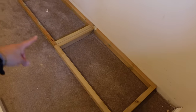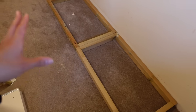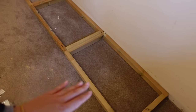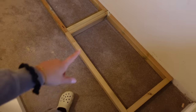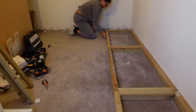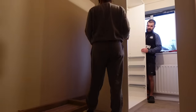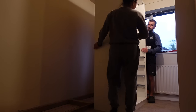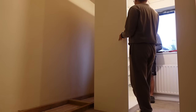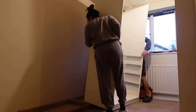Number one - we need to take the carpet from underneath. When you're laying things on carpet, it doesn't necessarily mean it's going to be level and straight. The best bet is to take the carpet off and lay on solid wood. We've already taken the skirting board off the wall, so we know exactly where we need to cut. We mark that with a Stanley knife, peel back the carpet, and cut it. Then we slide the base into place.